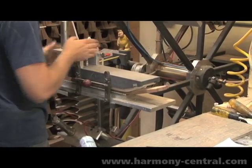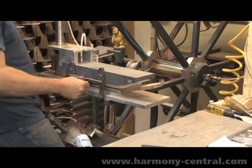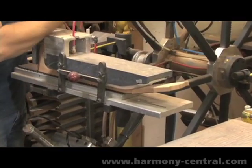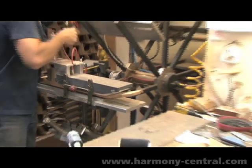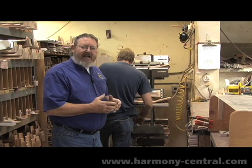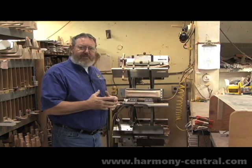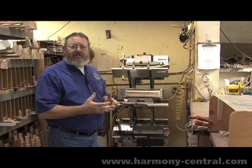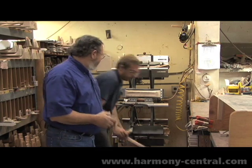Again, we're using fireman's hose because now we have a completely contoured shape that any application of a clamp other than something that might fill in contour to it would damage the finished product. We've carved that neck within a few thousandths of its finished profile based on a historic or a modern concept shape.